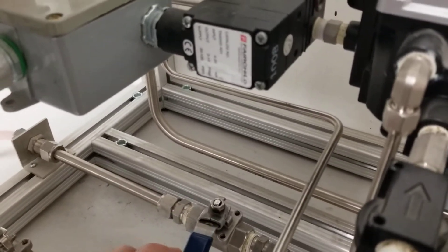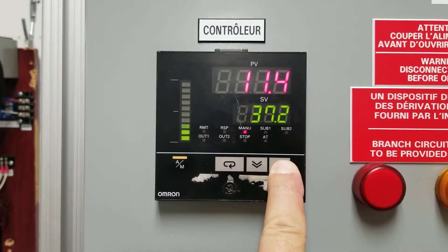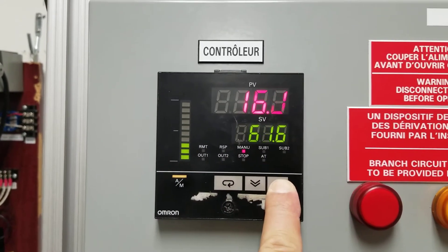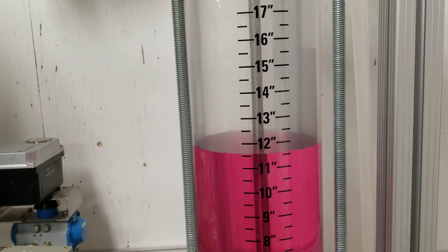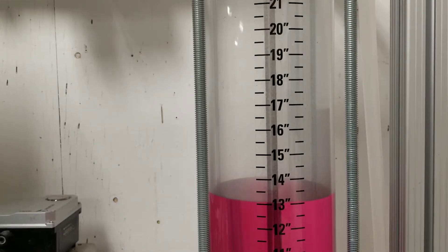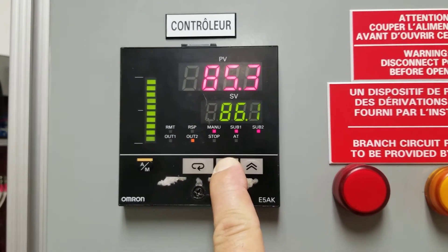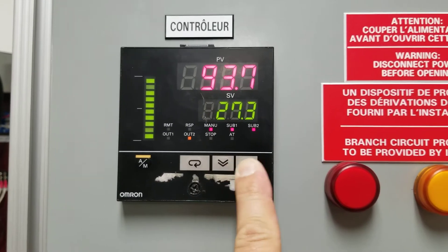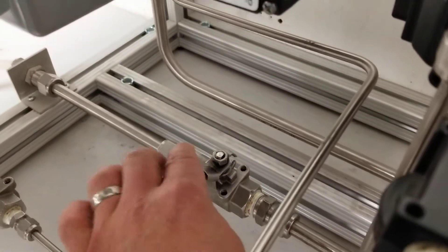The best way to do that is to close the valve so there's no water leaking through. Increase your set point in manual mode to 100%. There's about a 1 to 2 second lag. So you see the valve open 100% now and the liquid's rising pretty quick. In the background you hear the air compressor because it is a pneumatic valve. So let's say we want the max to be 20 inches. Once you start getting close to 20 inches, I suggest you start lowering this — this value is not going to kick in unless you let the push button go for more than about a second. So I'm going to go back to the magic number, which is about 30. It overshot, but that's fine — it's not an issue. My valve here is still completely closed, so I want to set this to 50% again — approximately a 45 degree angle.